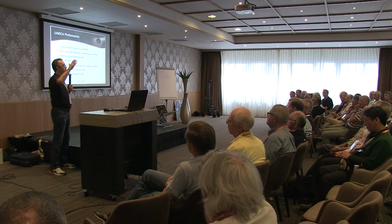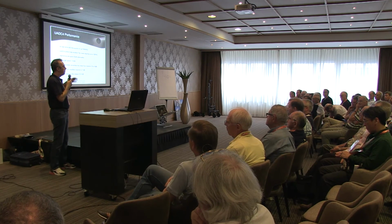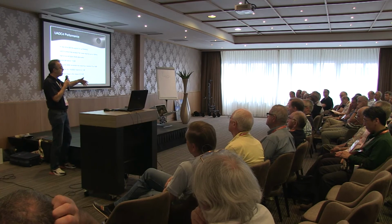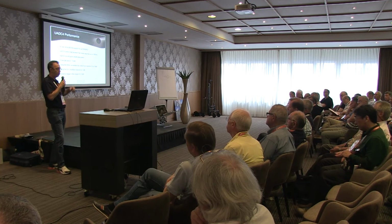But due to the reciprocal mixing from the local oscillator, I cannot claim totally these 17 dBs, I can claim 11 dBs. Better performance can be reached if you replace the local oscillator with a better one, there being many other options. And what is really important is that out of the box, without so many modifications, Live published an extensive comparison of all the audio cards available on the market, tested with software-defined radios. And the UADC4, just by removing the sound card and changing to the UADC4, was automatically positioned in position 1 in the table.